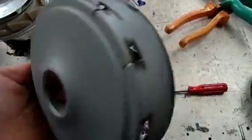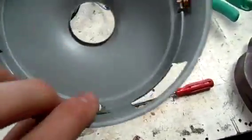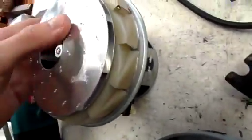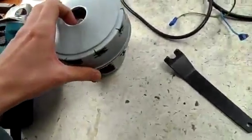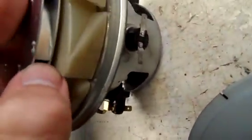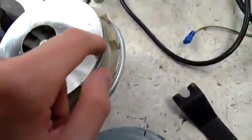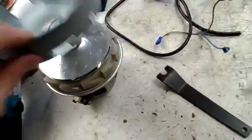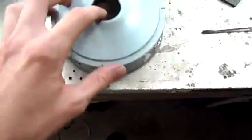The stator is all done. I ended up just using a grinder and as you can see, put two cuts once I marked out and then just another one going right across. Then just bent that little tag in to reach out to this so I can get it as close as possible - like you saw in the other video when I fixed up the proper siren. It just goes over the top, and once it's pressed down it should be right next to it. It's very simple - I just marked out where I wanted to cut it corresponding to the number of impeller fins. I think there's nine or something on these. Clamped it down onto the bench and used the four inch grinder to put the cuts in.